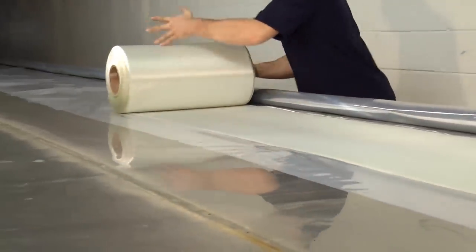Since the fiberglass is laid flat, once you roll it over the bladder it's not a tube, so it can conform to different shapes and sizes. We can usually go from one pipe size — say four inches to six inches — and do the transition perfectly without knowing exactly where it is down the line, because it will conform. Like a rolled newspaper, it's going to open up, which a tube can't do — with a tube you have to make sure you know where it is and position it. Our repair is going to conform to offsets as well, because the repair doesn't have a predetermined shape or a predetermined size.